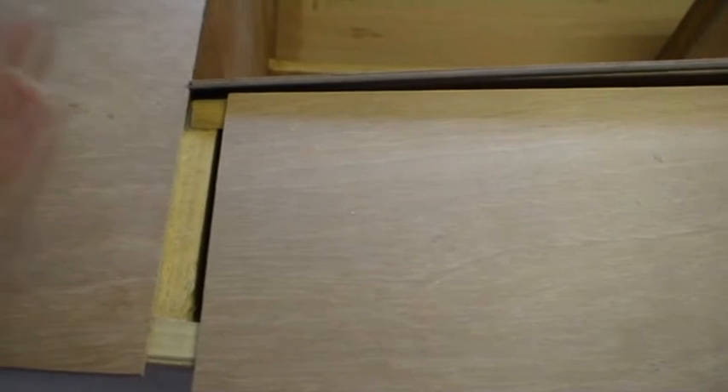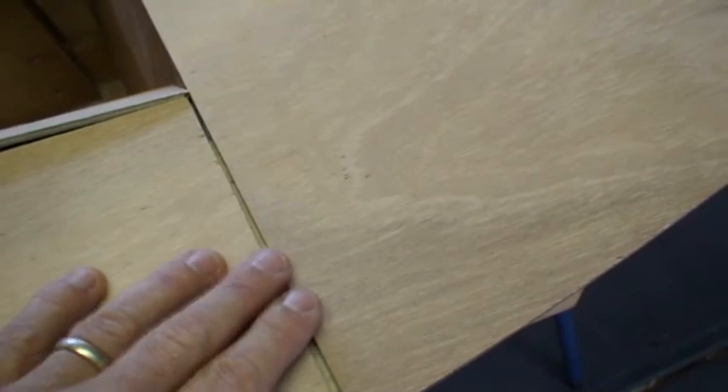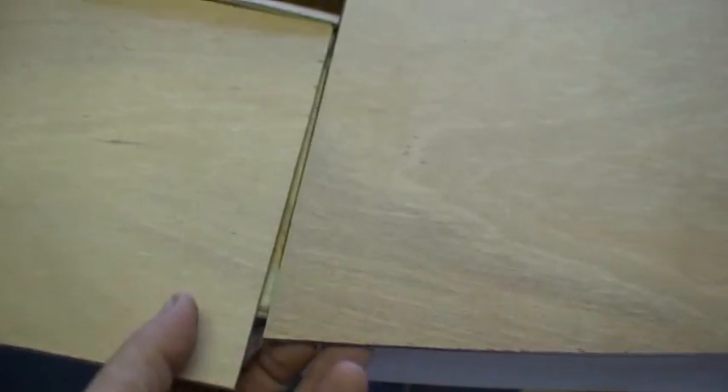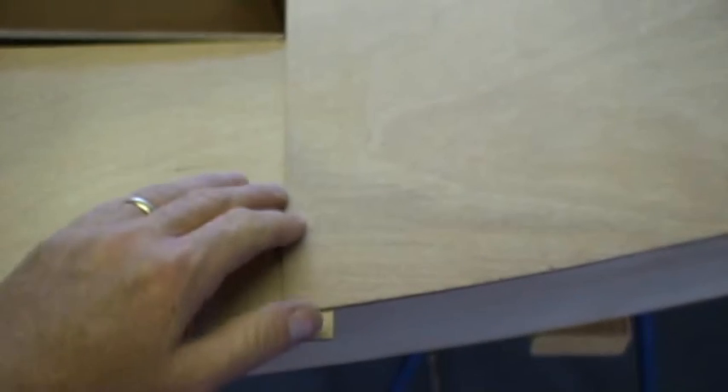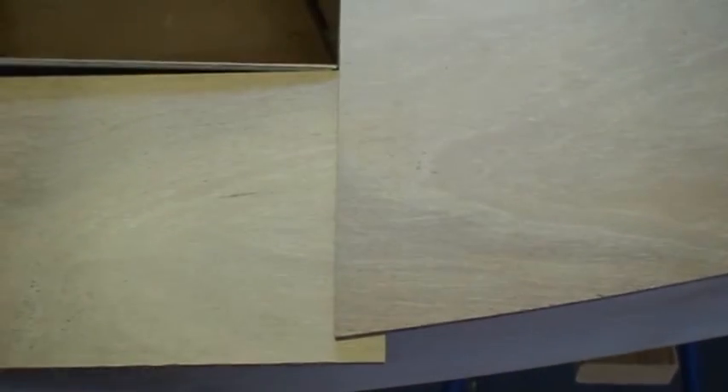That gives you another nice straight edge down the side of your side decking, which you can scribe with a Stanley knife or a sharp knife to cut through that veneer, then cut to that line and plane up to it. That should give you a nice straight edge which you know is a perfect match to this aft decking. What we then do is move that forward at the front end to get the same sort of joint there. Normally this piece would be longer; we sit the side decking under the forward decking so we have an overlap, then use the sharp knife to scribe down on the aft end of the forward deck, which means everything will fit into place at the right angles.